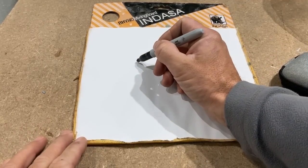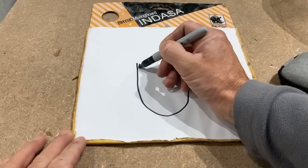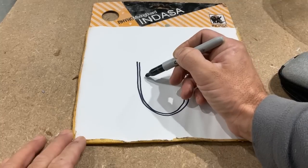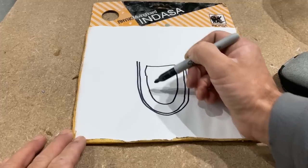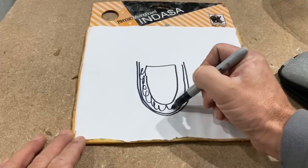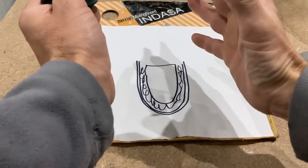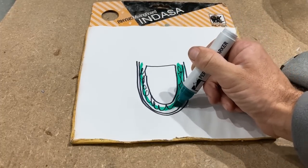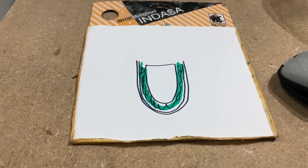So if you can imagine, the keel should kinda look like this. That's the outer glass fiber skin. In the middle of here is a big chunk of lead, and that lead is sitting in kind of resin there. I probably ought to do that in a different color, as I have two colors. When they build the boats, they build the two halves of the hull, put them together, glass them together, and then they drop a load of resin with chop strands in it in here, and then they drop the lead down into it, and that all goes off, and that's all good.